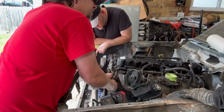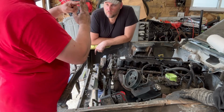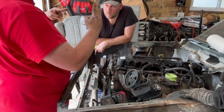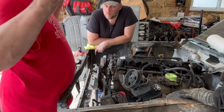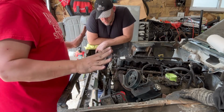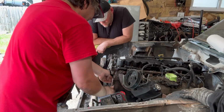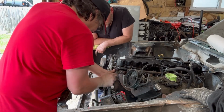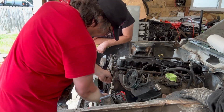I said, explain. He goes, with the fluid inside, when you turn it in, that thread grabs some fluid, and then when you turn it out, it lubricates the thread on the way out. I'm like, okay, whatever, it just works. I don't know if your theory's right, but I did the same thing here, right? Which I know we broke it off, but I was like, tighten first there. I know you don't want to, but do it. So right now I'm just exercising that thread.